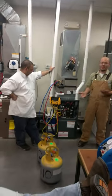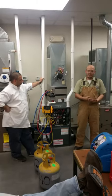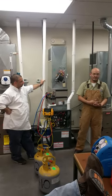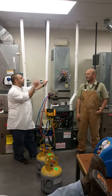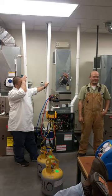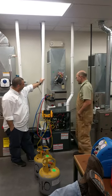There's a different TXV for R410A versus R22. The easiest way to do it is go up to the condensing unit. Look at the placard — it should say R410A or R22, because that's the mother ship, that's what's doing all the work. So based on that, we're on system number 2.